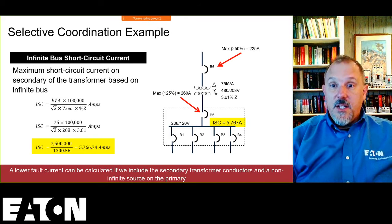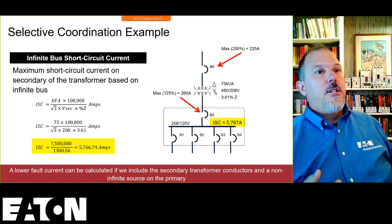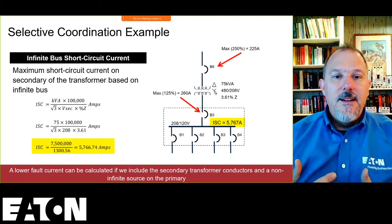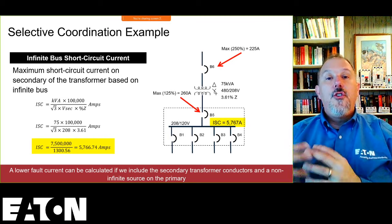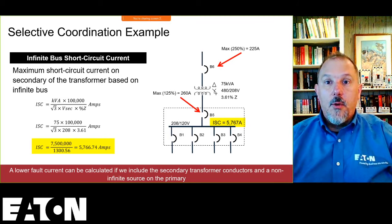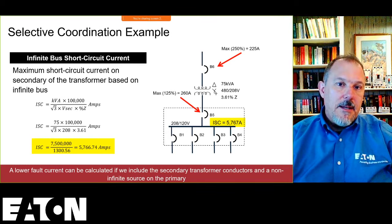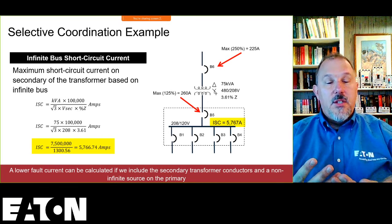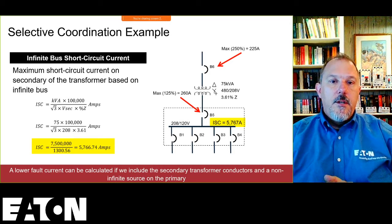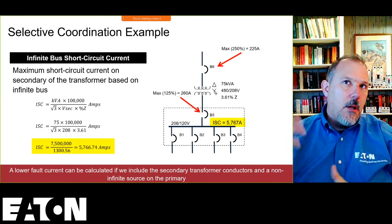You change the transformer out. If you're in the design phase, for example, and the transformer you get in has a lower impedance than what you've used in your design, you may not selectively coordinate or even coordinate, for all that matters, at whatever fault current value you picked, because the values are going to be different. So my guidance would be, make sure you're choosing. If you choose the worst case, yes, it could put you into a larger